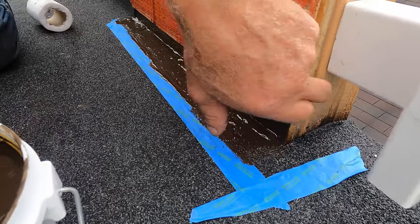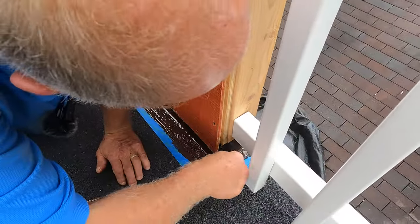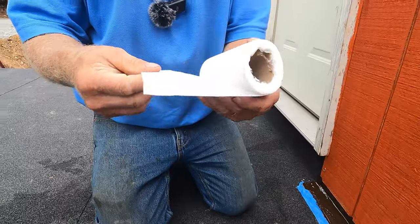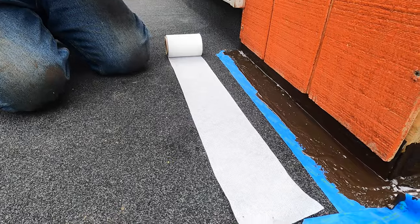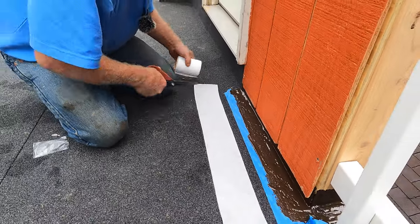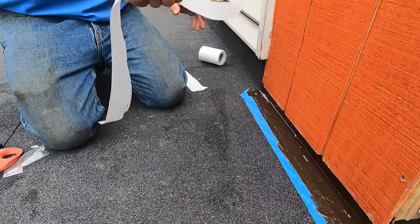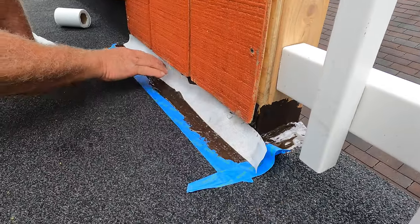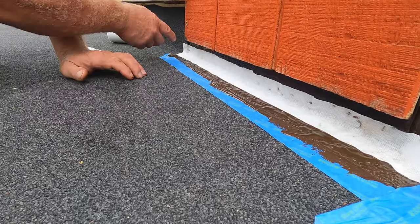Let's say you want to do the flashing on this post — there's some wood there that didn't get flashed. I'll do the same in this case right there, cover that wood around the corner. Here's the fleece — this polyester fabric has a special softness to it, it's not just any polyester. I cut the length like this. It comes four inches wide so I'm going to make it two inches wide, cutting it down the middle. I put it right there in the corner, going up the flashing and on the membrane, just like that.